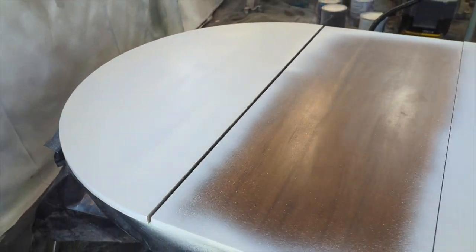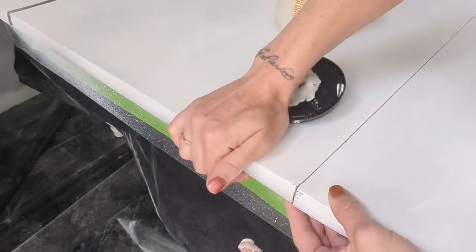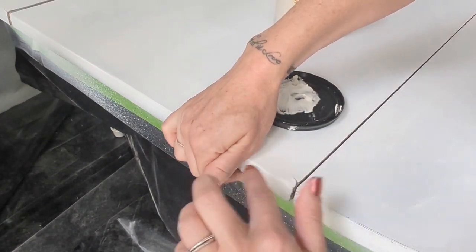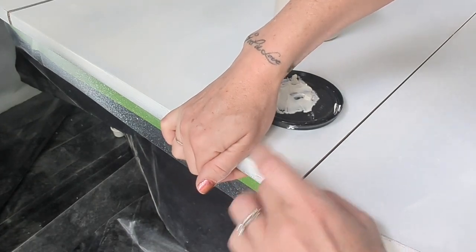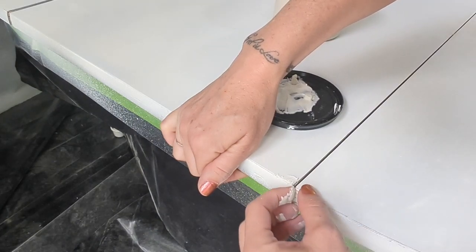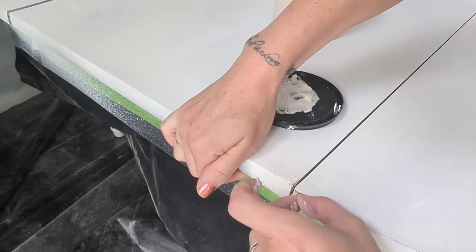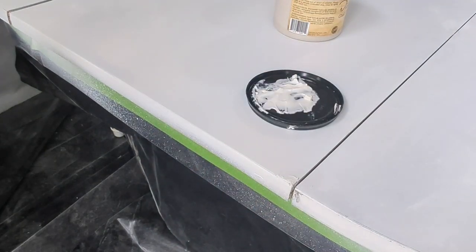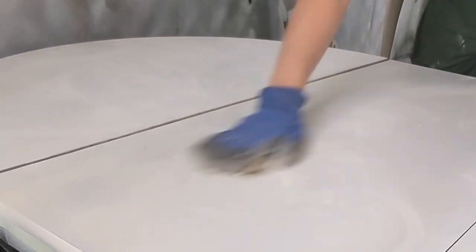Instead of doing a stained top, I decided I needed to do a painted top. So I primed it all with primer, and then I could see more of the damage that needed to get fixed. I'm using just wood filler, sanding it back down on any divots on the top, and making sure every divot is filled — because with that water damage you could tell from certain angles that it was raised up. When the wood filler is dry, you want to sand it all the way through, and this is when you can sand your primer as well.